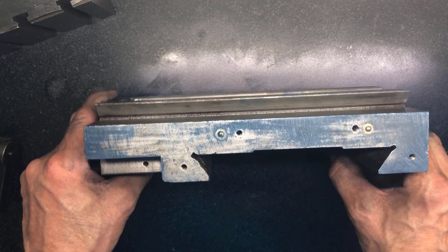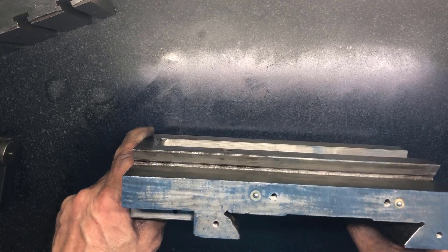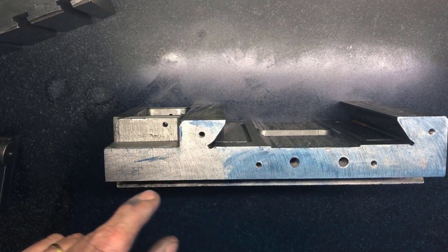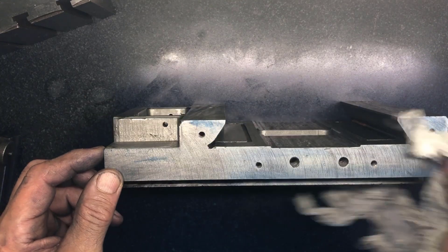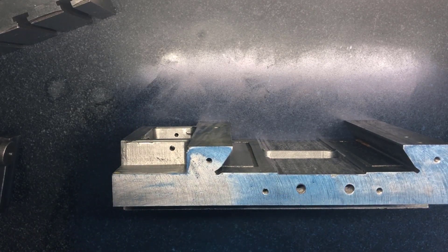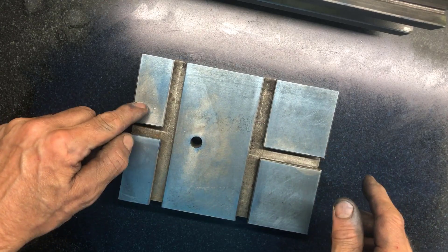Not bad at all really. These two areas will of course be depressed, so we can test them - and then we will test the dovetails. It's quite flat all over; there's a shiny spot there that could be the one preventing this from meeting there. So it's high there, but anyway. The top ground surface here is, I would say, absolutely flat - so a minor, minor flaw there.